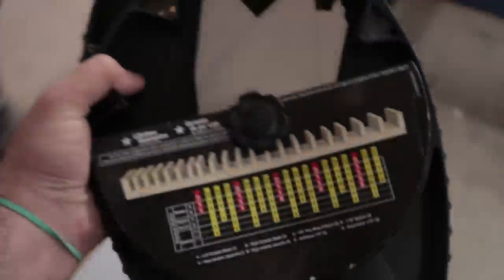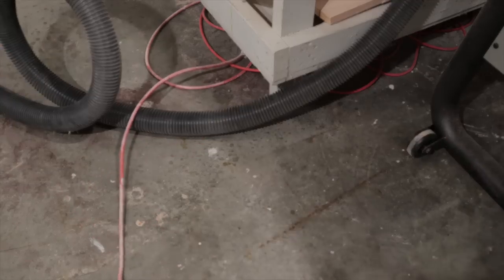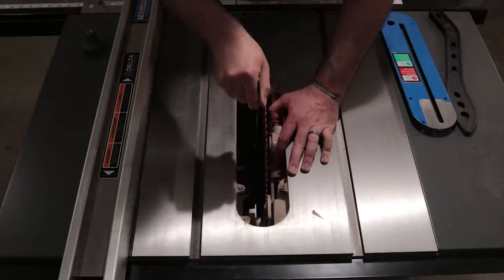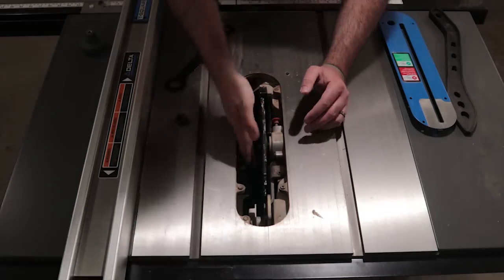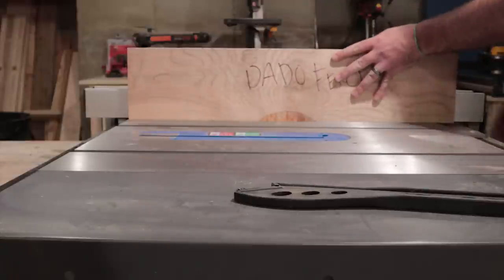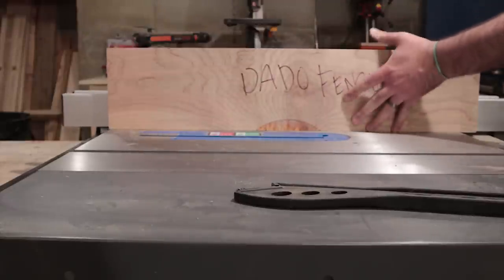I ended up using my dado blades on the table saw to cut out the rabbets on the inside edge of the frame. I set them to the minimum thickness, which was 1/4 inch, and then I raised the blade to 1/4 inch high. I would have used my router, but I don't have a rabbeting bit that matches the dimensions I was going for.